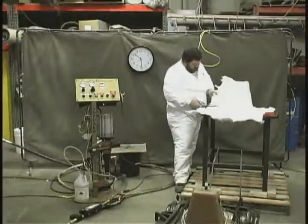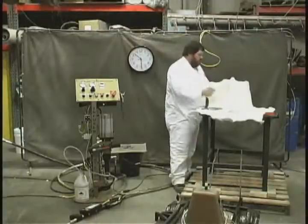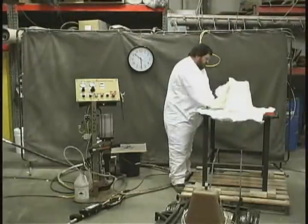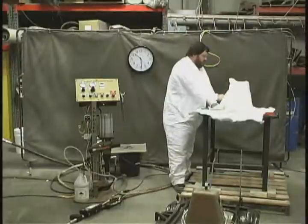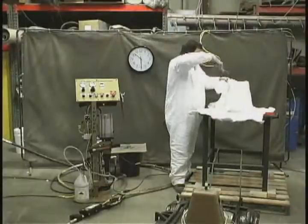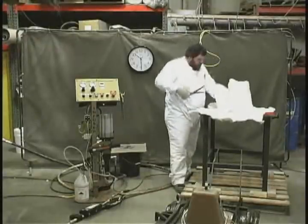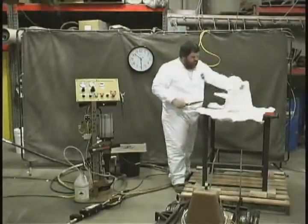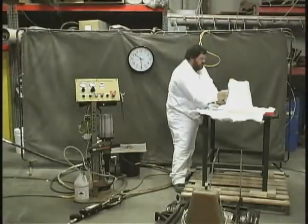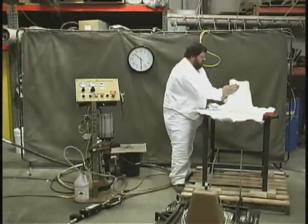Don is doing all this cutting on the molding as it were. If we were set up for production of this part, he would have had this more cut to shape using a template — often masonite or plexiglass — and most of these cuts would have been in place already. Though these materials stretch, you can't necessarily die-cut to the exact shape, which would significantly reduce the time. What we're showing here is basically as though it were the first time the part had been loaded, so the time shown in this elapsed molding is not optimized.